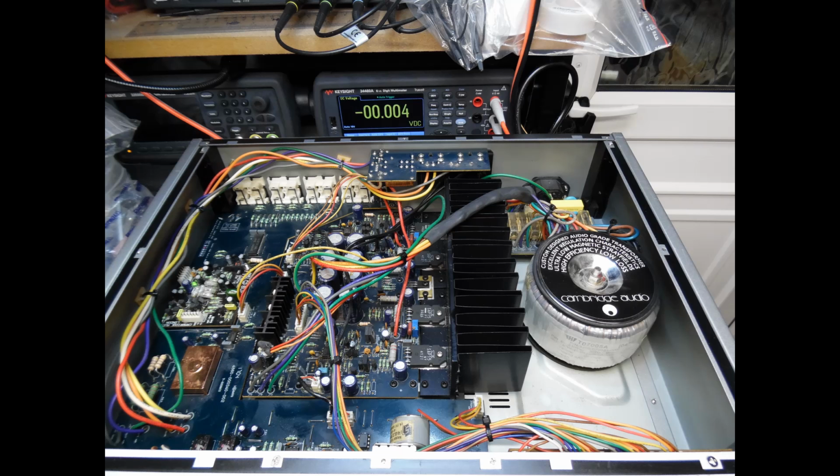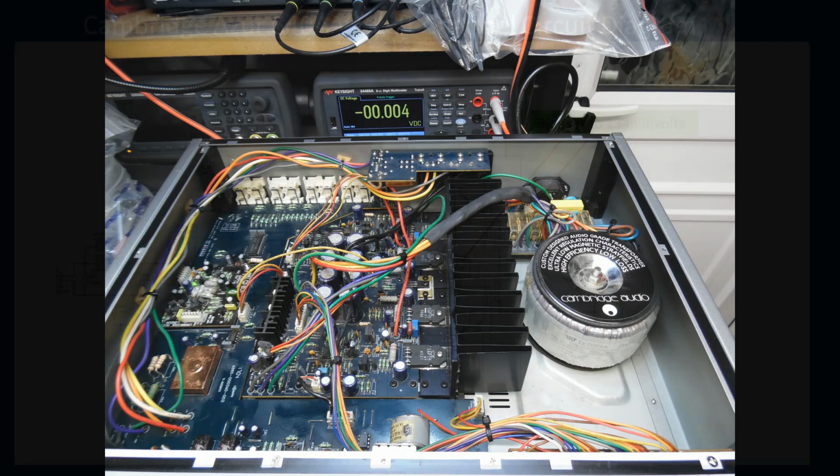So this is the tone switch, tone defeat switch, and then also the speaker selection 2 switch, and also the headphone socket. And remember, when you're checking for dry joints, as we said on other tutorials, just verify mechanical stress. You might find some cracking around the headphone socket, or as we mentioned previously, the user controls. Just make sure that there's no underlying issue there.